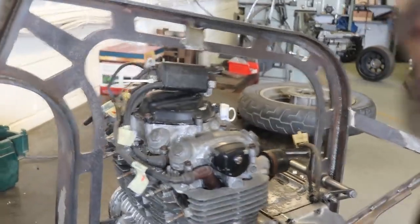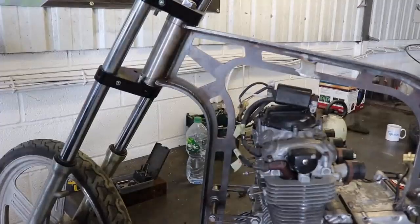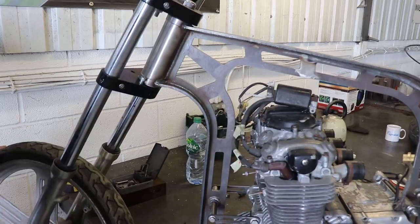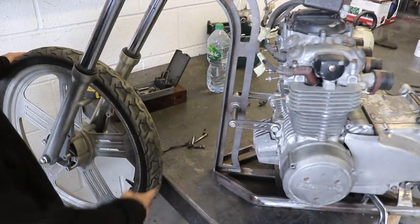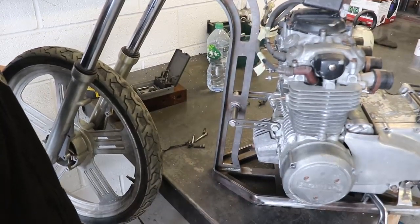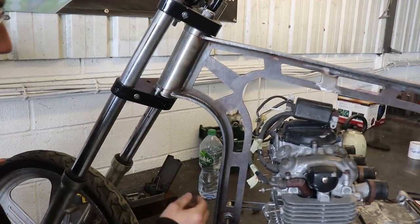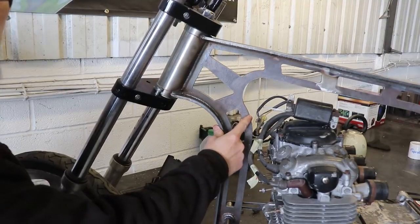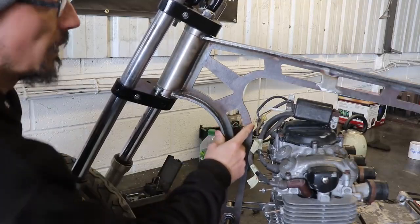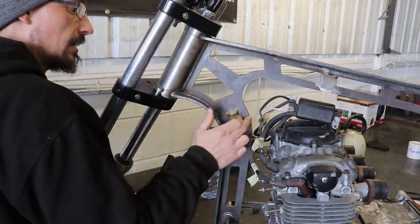Also, with the bike sat clamped to the bench like that, I can pull on this wheel and flex the top of this neck over where this wheel's pushing against here. I can force this wheel over and just see how it's flexing the frame. And it's pretty rigid apart from here. You can see just on the inside of this neck. I'm not sure if you can really see it on there, but when you eyeball down through here, you can see that it's flexing there.